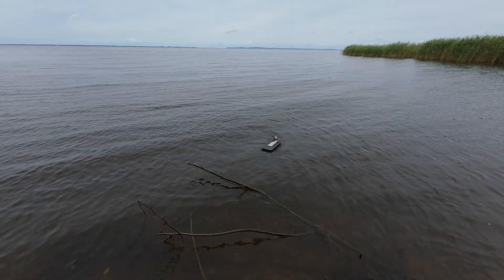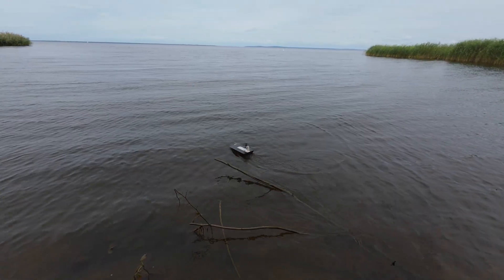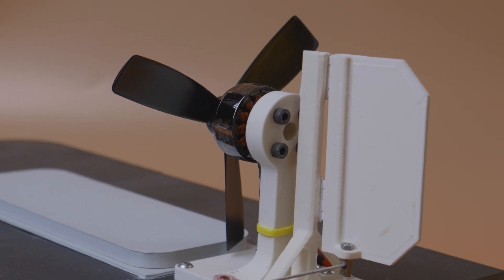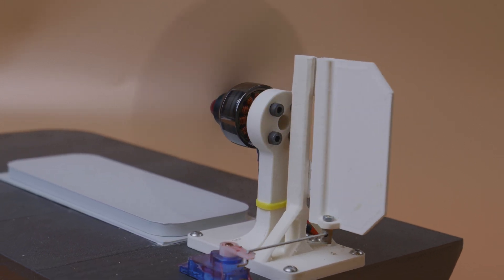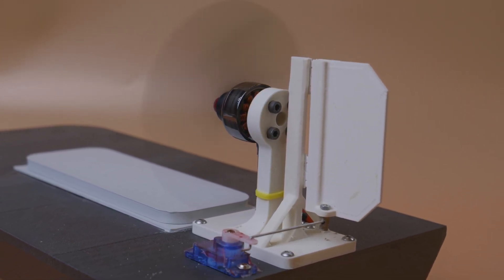In the beginning you could actually steer it, but only after a few minutes in the water, instead of going forward, it was only spinning circles. Most probably those issues could be resolved by either printing a slightly bigger boat with more buoyancy, or using a lighter battery and motor. If I decide to redesign this project, I will definitely make it taller, make it bigger, and most probably try to increase the buoyancy by at least 50%.